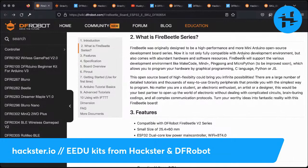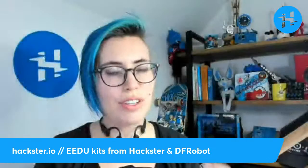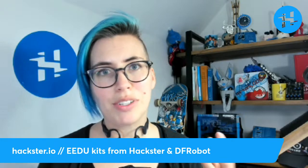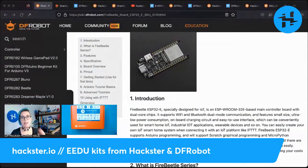They are looking at providing advanced support for MicroPython — that one seems to be the closest to being supported. They're also talking about Scratch, MakeCode, MindPlus, PingPong, etc. And then we've also got some castellated edges on here. These kits are designed for getting started in each of these fields, so we don't expect you to have a lot of skills already around building electronics. But if you wanted to, because this board has castellated edges, you can embed it on top of your own PCB, which is pretty cool.